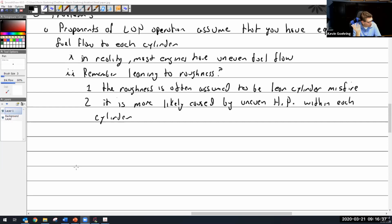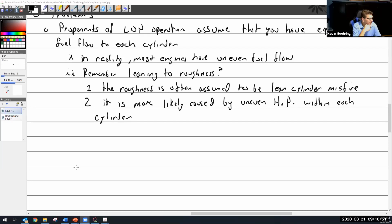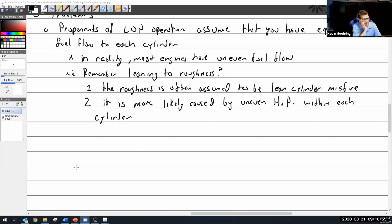Don't forget you do a borescope, and we've got valves with some green staining on them. Good or bad? Bad. Green is always bad. Green means stop, right? So you have to call the customer and you're going to say, I've got really bad news for you. You got burnt valves. You've got 4 burned exhaust valves.